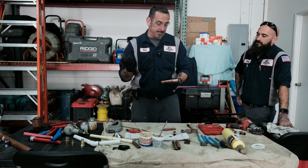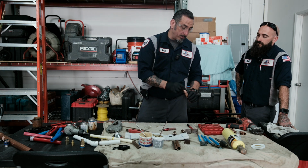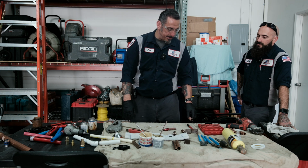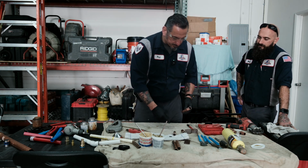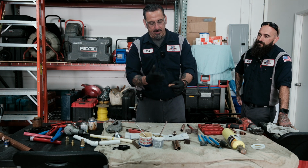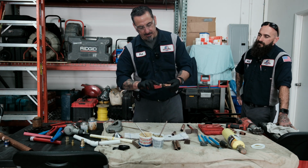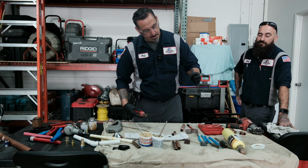It's really the better flow of water through the pipe, and it doesn't create turbulence. So this is very important. With your fitting, they make, of course, fittings for 90-degree elbows, T's, 45s, couplings. You also want to clean your fitting. Very important for this application.